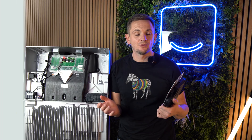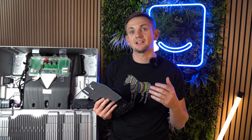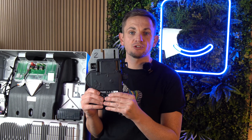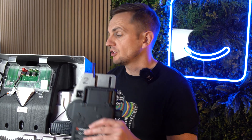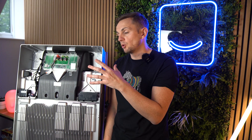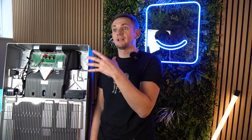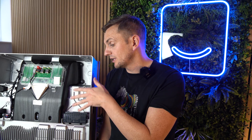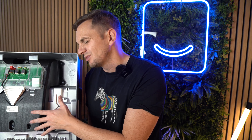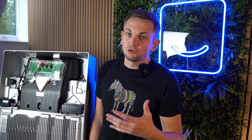One more important point about combining AC and DC coupling: you'd technically have more power available for your home. For example, if you had 10 micro inverters producing 3 kilowatts AC coupled to the Powerwall, you could power your home with 3 kilowatts from PV plus up to 11 kilowatts from the Powerwall — a theoretical 14 kilowatts total. If you DC couple only, you're always limited by the 11 kilowatt inverter, which is still impressive compared to a typical 5 kilowatt inverter.